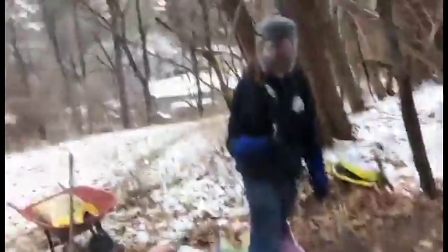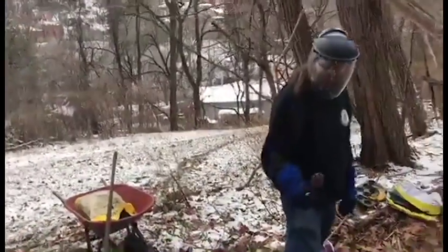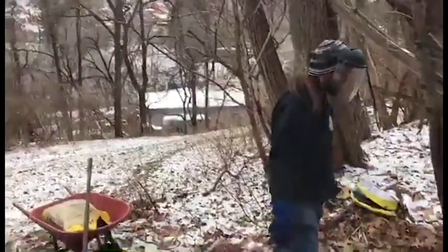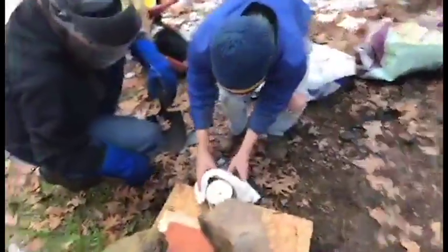With my fancy drawstring. We're using nothing for what it was meant to do — I don't think the designer of this stainless steel spoon intended it for scooping coal pieces off of molten bronze. We're cooking metal! The thermometer has overtaxed — it has reached its peak over 2,000 degrees. Glowing inside. Nice! That insulating wool can take a ton of heat. That's kaowool, which is like ceramic fiber — normal house insulation is fiberglass but this is ceramic basically. That's still glowing and it's been out for a while — that's that little hacked kiln. That's beautiful.